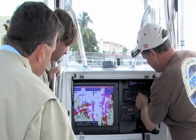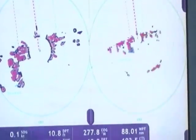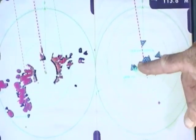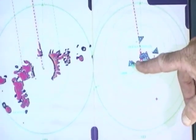One system is in a head-up configuration, and I'm going to make this one match — I'm actually going to go into a north-up presentation so that they actually match. I'll zoom out a little bit more and just show you what it looks like at a little bit longer range. There's the coast off Pompano Beach. If I zoom out a little bit more, you can actually see I'm probably picking up some ship targets out here about one and a half miles away.